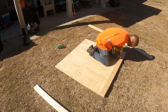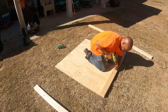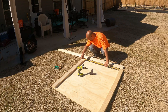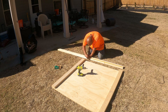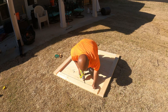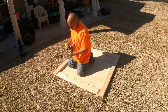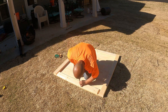In this video you can see me cutting the two-by-fours down to size while being mindful to leave two small gaps for the hoses to slip through. Don't be afraid to use a lot of screws — I'm using two-and-a-half-inch exterior deck screws so I don't have to worry about rusting down the line. This part of the project, which involved mostly cutting, took about 30 minutes.